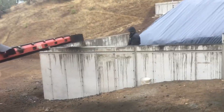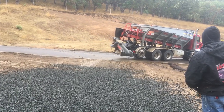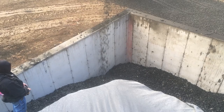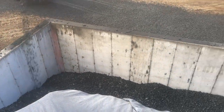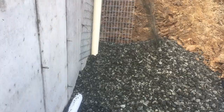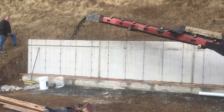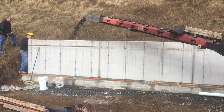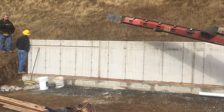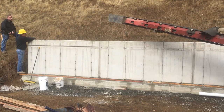Look at this truck — one of the slickest tools you'll ever see. It is being controlled remotely by Kelly Sconce so that he can operate the truck forward and reverse, steer it, move it slower or faster, speed up the conveyor carrying the rock out of the bed, speed up the rate the conveyor is spinning to actually throw the rock onto the site, and move that conveyor left and right and up and down to place it pretty much exactly where he wants it. That thing will hurl a rock up to 80 feet from the back of the truck. When he's got it spun up like that you don't want to be standing anywhere near the impact zone, because those things will hurt you. But in applications like this it's turning much slower, and he's putting exactly the amount of rock in here that I need. We're burying the pipe.